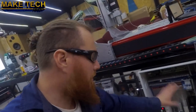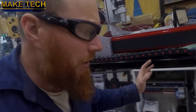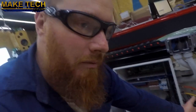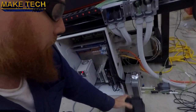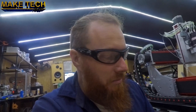I've got this fairly well finished off — there's still a bit of cable I need to trim off but I'll leave that till the end when it's all working and tested. I haven't really talked about this stuff yet. This is a reservoir — it's an oil catch can like for a race car, and I've just put these massive heat sinks on there. This 3D print I've done will force air through that if it needs it. This little aquarium pump works — once it's primed it's flowing nicely.